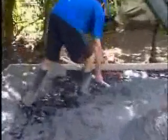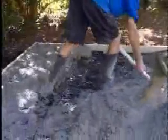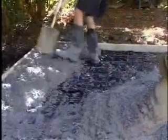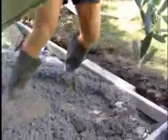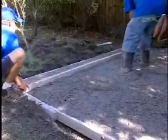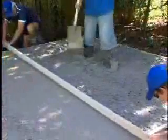This particular slab will require 1 cubic metre of concrete, and we are using a 20 MPa concrete mix, which basically means the stones or gravel used is 20mm. Pour the concrete in and level it out with shovels to the height of the boxing. Screed the concrete off with an aluminium screed or a length of timber.